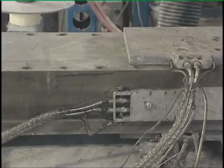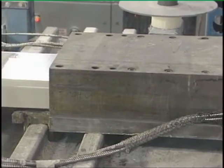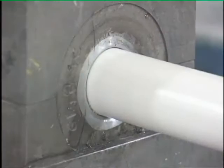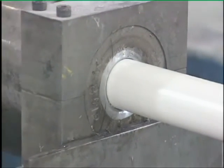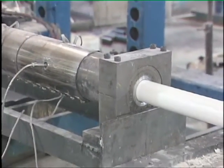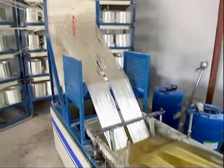The reinforcement materials, such as rolls of fiberglass mat and drops of fiberglass roving, are saturated with the resin mixture in the resin bath and pulled through the die. The gelation or hardening of the resin is initiated by the heat from the die, and a rigid cured profile is formed corresponding to the shape of the die.